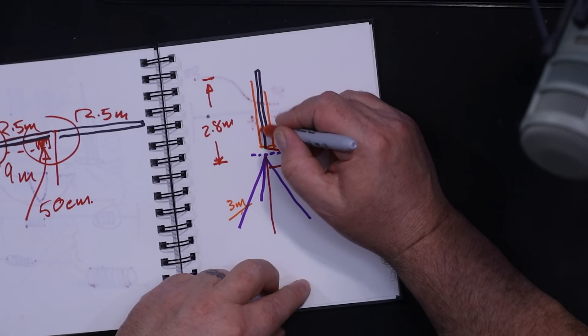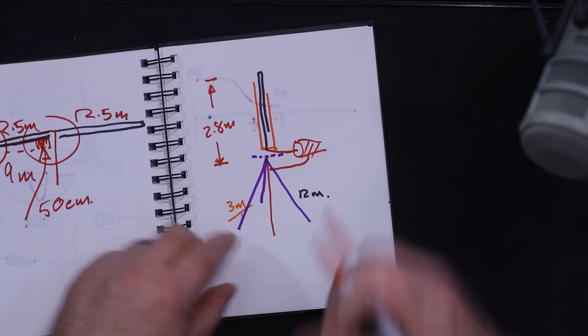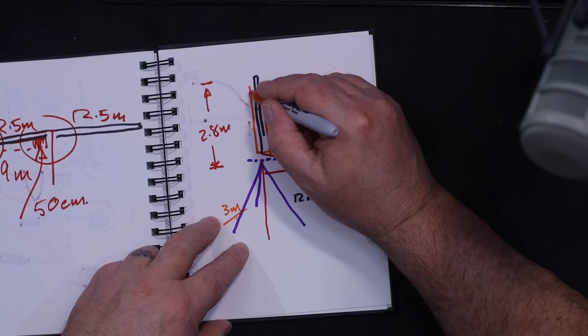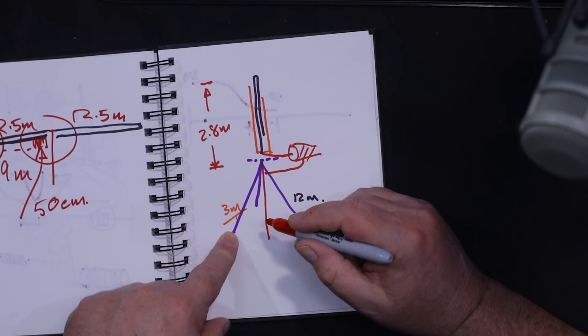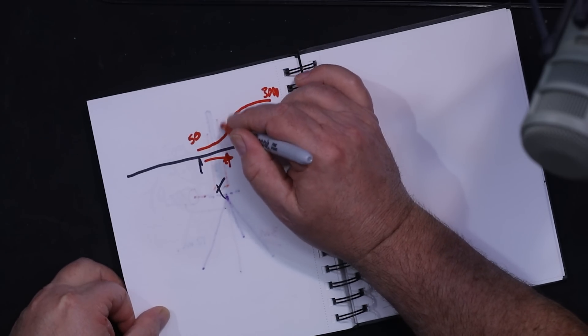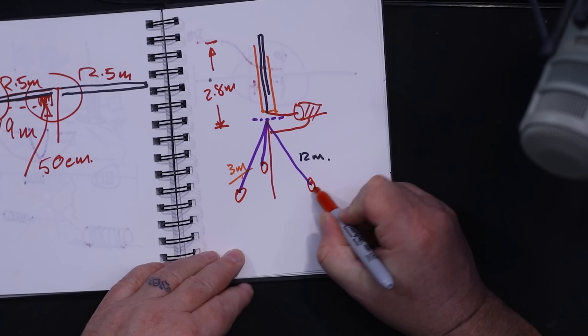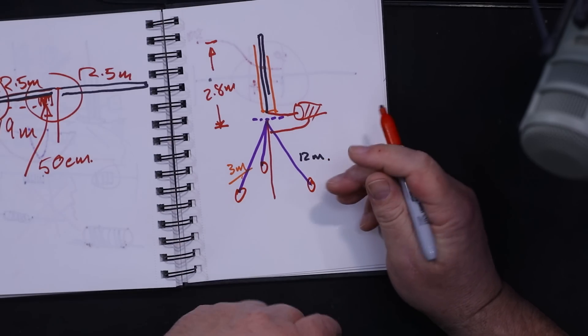If we transpose that to off-center feeding the 15-meter element — where that element is a little bit longer than the legs — we're still in the range of that tangent curve, which is between about 40 and 60 ohms. I was getting a perfect match as it happens. Same with 12 meters — the legs were just a tiny bit too long — and same on 10 meters. We were still inside that flat part of the curve, getting 50 to 60 ohms and a perfect match. So I was sharing these elevated radials across all three elements.